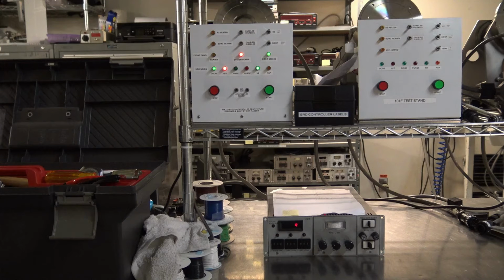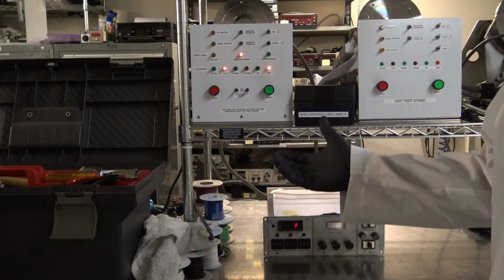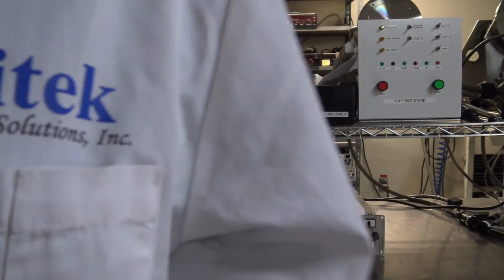So it should be within the next 5-10 seconds that our RSP fires here. In our next video, we're going to move on to the digital 101 controllers, and I'll have 2 of those for you where we're going to run test cycles as well. Okay, RSP is fired. We have our indicator here. It'd now be safe to open the door and remove your dry wafers from your SRD. I'm going to go ahead and shut off the camera so we can get the next controller set up.